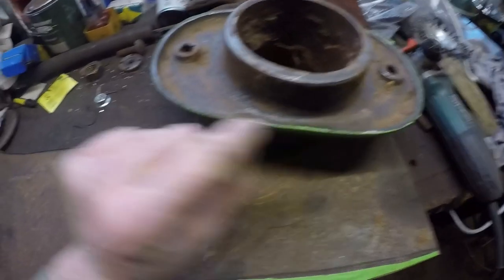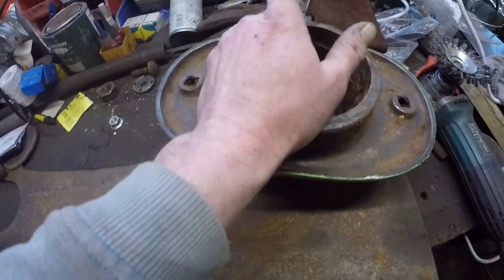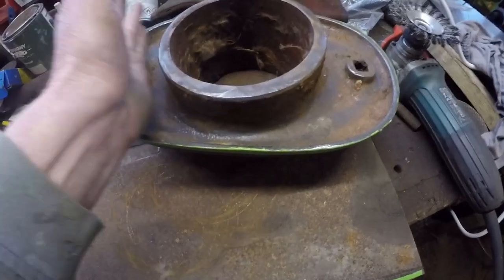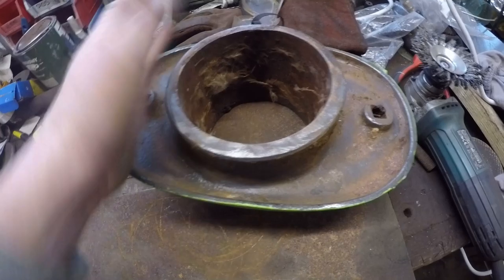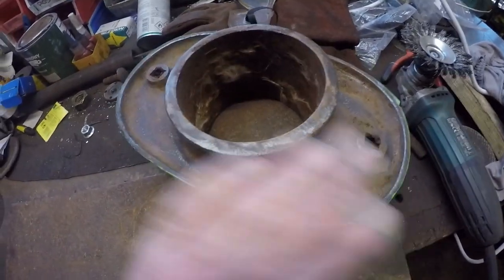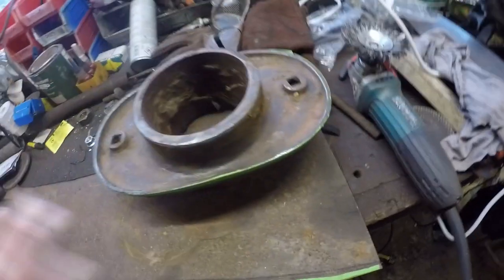It's a funny little curved shape that I can then cut out of metal, bend it round and weld it. Bear in mind this is cast iron - for this application welding cast with steel is fine, doesn't cause a problem at all. Couldn't do it for anything structural or anything that needed to be strong, but for this, just for a visual, it's fine. I'll weld it around, follow it around, grind it all nice, put it on the roof and that will take up the gap.